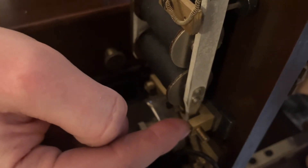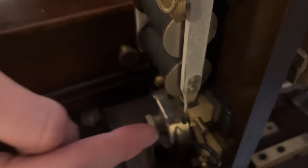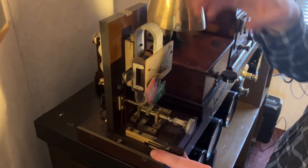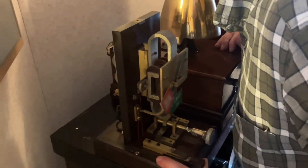If you have a look at the relay here, this is in its standard configuration. At the moment it's making an electrical contact against this side, but not against the side with the exposed screw. Our bell is connected to this side here. So as soon as the power is taken off, the spring will pull the armature back — because the pivot's here — and that will spring forward and make the contact. So it's a fairly simple system, but it's very delicate. You've got to be careful when you are adjusting the springs and the contacts in the back. But as with most things, as long as you take due care and attention, it will be fine.